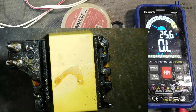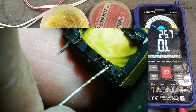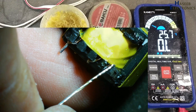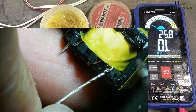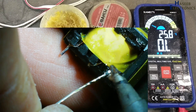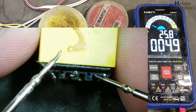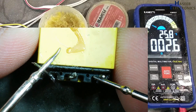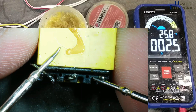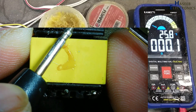The pin is damaged from the bobbin. I will solder this winding directly into the PCB. This is the resistance of the primary winding; and this is the secondary winding.